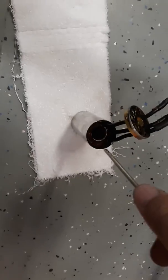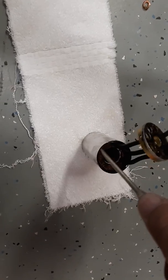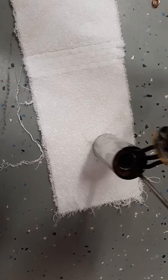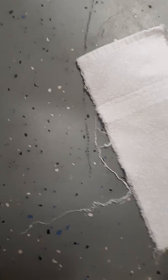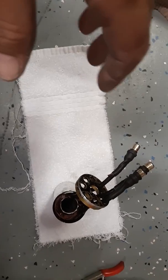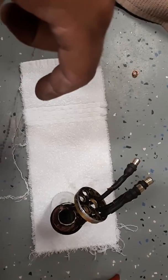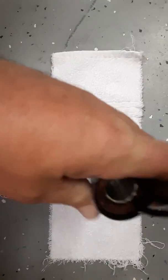After spraying, come over to your air compressor and blow it out real good. If you don't have an air compressor, you can use computer cleaner — the stuff that comes in a can. Just don't hold it upside down; hold it straight up and it'll blow out everything in there. You want to get it all out, spray from either direction to get all the dirt out.